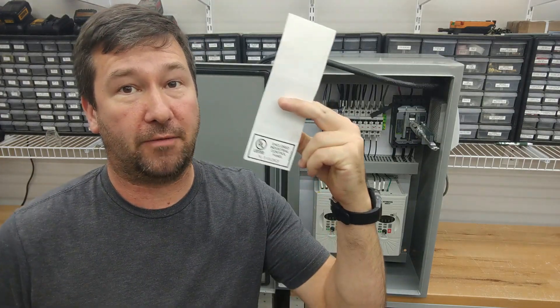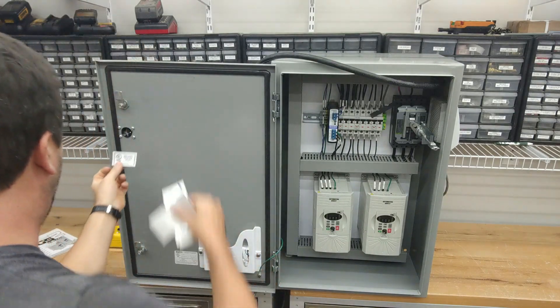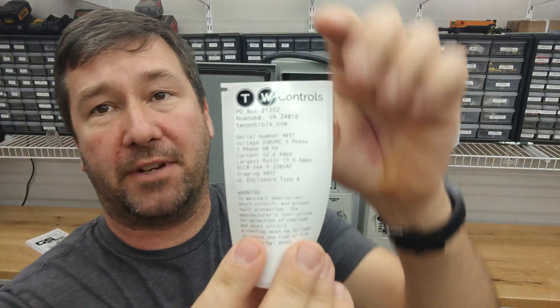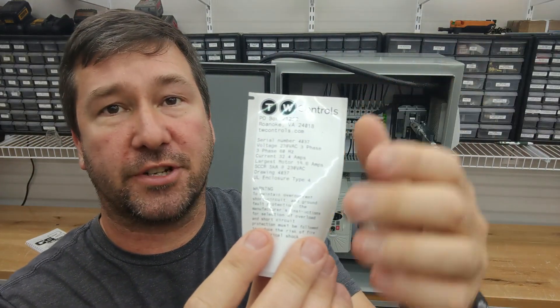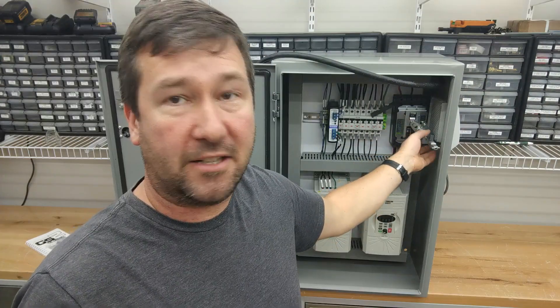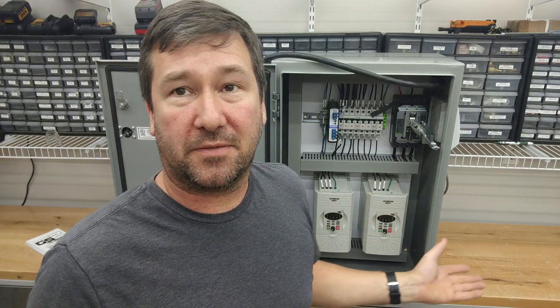There are a few finishing touches for our panel. First of all, we are a UL 508A panel manufacturer so we need to fix our label to it. You should also have a nameplate label with information the electrician will need to install it, such as the voltage and the full load amps. Yes, he can look inside and see this is a 60 amp disconnect, but that doesn't tell him the full load amps — which an electrician really needs for his calculations — and he shouldn't have to open the panel to do it.